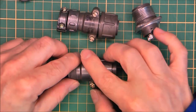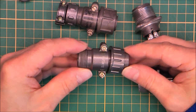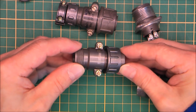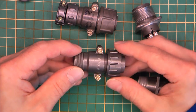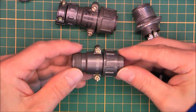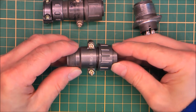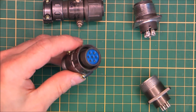I will check also about this back shell part. I did find one problem with the Chinese connector — there is actually some play in the connector, in the cover piece. It will move a little bit. Maybe it can be corrected by applying some Kapton tape inside or filing down a little bit. This problem does not exist on the Soviet one.